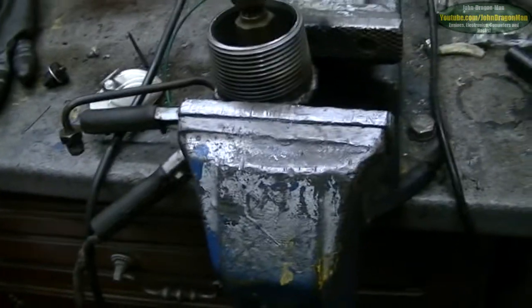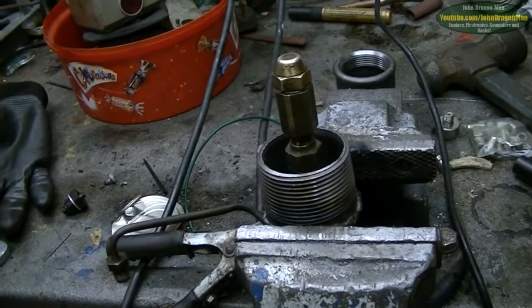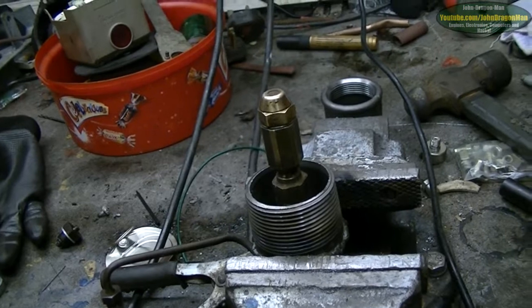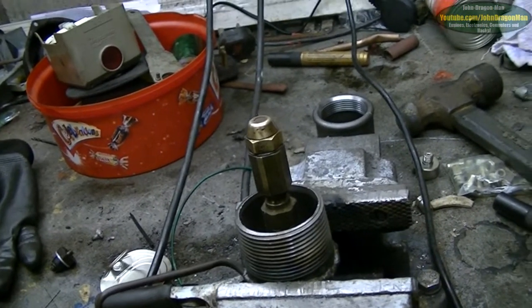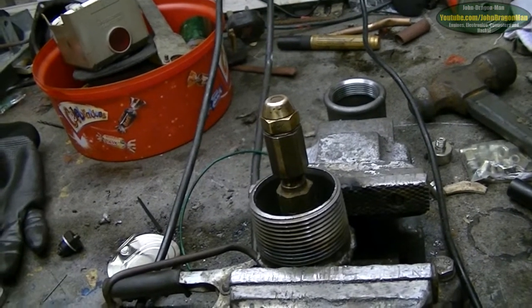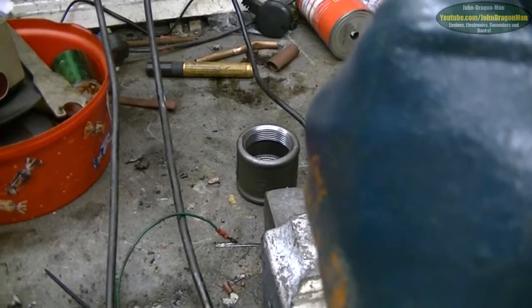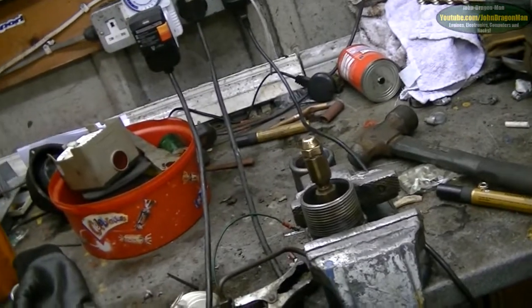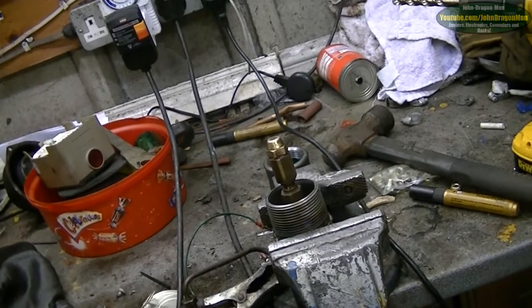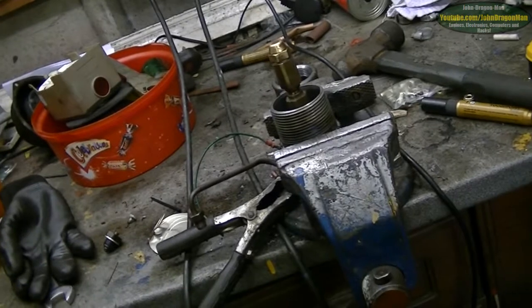There's a bloke on YouTube who's made a Babington burner. Most Babington burners work by having a bulb-shaped or ball-shaped device that oil drips over, with a small hole drilled in it. The oil drips over it - I'll ask the guy's permission if I can link his video in the description. It works by oil flowing over the ball, and on the very edge of the ball - like where my knuckle is - there's a little hole, and that shoots it out as a fine mist. The hole normally needs to be 0.01 of an inch, which works out roughly as 0.25 of a millimetre - so a quarter of a millimetre.